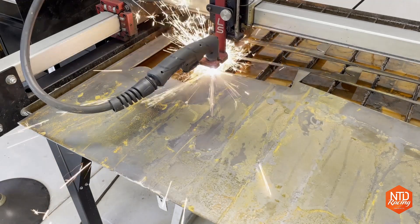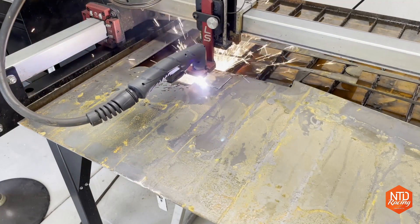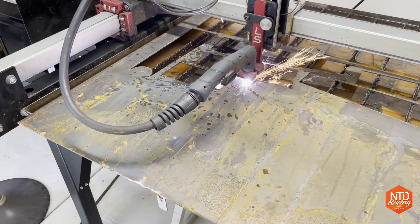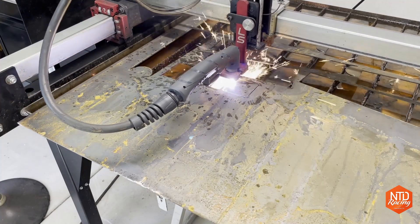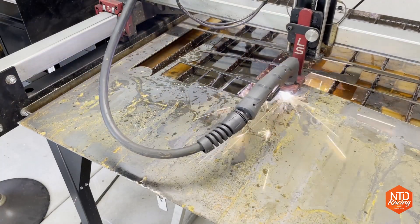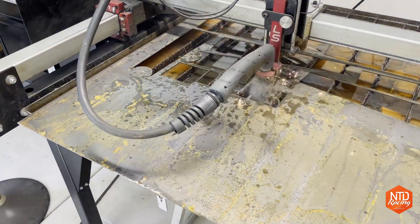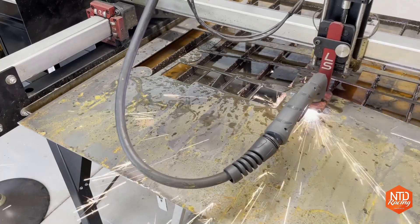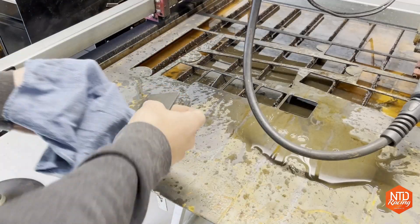As you can see, I had no problem with the consumables in this case — no misfires from the torch. In this video I'm cutting 11-gauge steel at 65 inches per minute, and I'm using 45 inches per minute for the lead in and lead out. That tends to work pretty well for about eighth-inch steel. As far as the compressor goes, since it's going through so many fittings, I haven't had problems with pressure — especially from that DeWalt single-stage. It'll run down to about 110 PSI, kick on the compressor, and come right back up to 150. I never have problems with the volume of air demanded by the Razorweld.